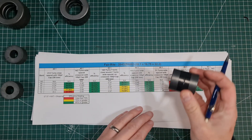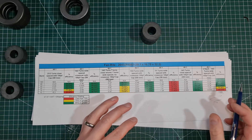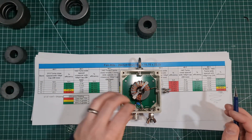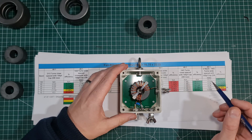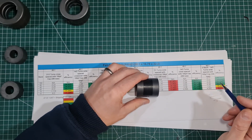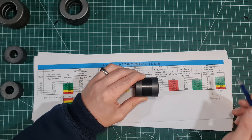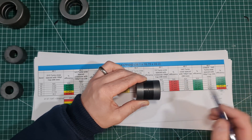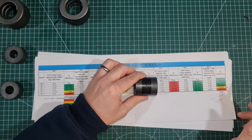That's only half the story though. Those are the efficiency numbers, but that doesn't mean we can just make this into an antenna. We'd need to put this into a box, wind it again, connect it up, and actually see how it performs as an antenna — because it doesn't necessarily mean it will antenna well. We'd need to check the match on all bands, and the SWR dips where it's resonant may not be in the positions we want, so there may be some compromise.